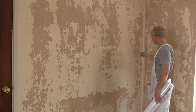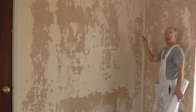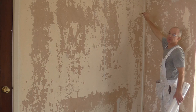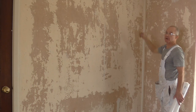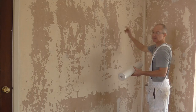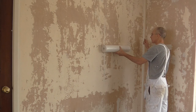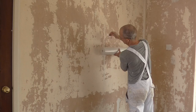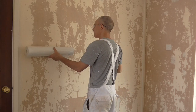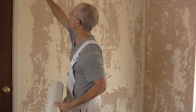I've just pulled my line down. Basically what I usually do is look for the deepest part where the wall blows in, and that's where I'll measure out from, then pull my line off that. You can work out how many lengths you need for that wall by going off your plumb line marks: that's one, two, three and four — so a little piece left at the end there, which I'm going to splice at the top.